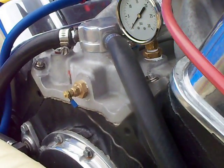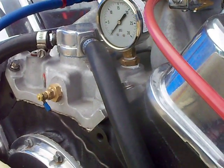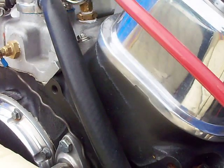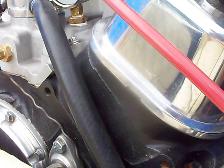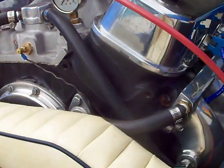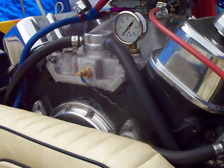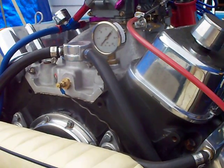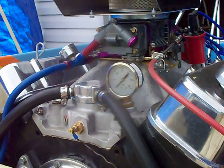Because you have a half-inch water line coming in that then goes to a three-quarter-inch line, the water volume opens up within the motor. You have all these big chambers that the water needs to fill, and when you have no pressure it doesn't have enough pressure to fill those empty gaps. You actually end up with hot spots within your motor. You need pressure — pressure indicates that you've filled all the voids inside the motor. If you're not reading pressure, water is just running through and you have voids creating hot spots, so the motor won't run to its full potential.